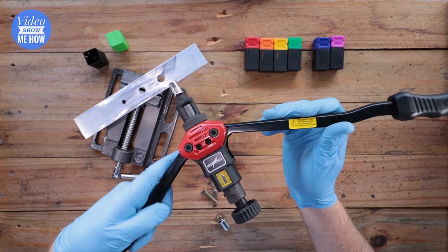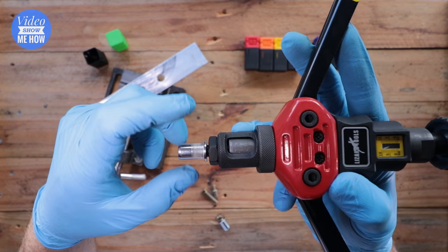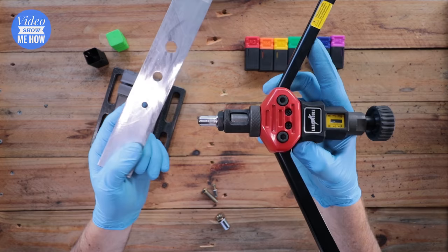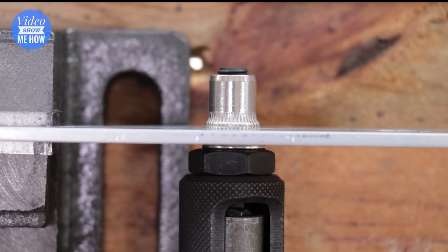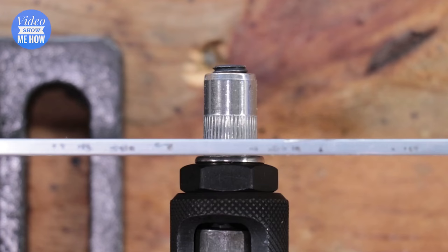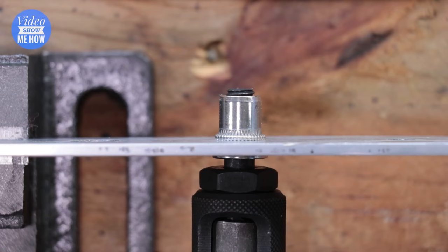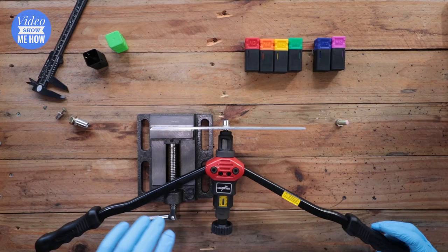Open the tool's jaws all the way out so you can see the gap, then screw it all the way down until you feel some resistance when you pull on the tool — don't squeeze it just yet. Insert it into your hole, making sure the mating surface and shoulder are nice and flush, then start squeezing together while pressing down towards the surface. You'll see it start crushing the nutsert onto the surface, creating a bead running around the inside of your surface.